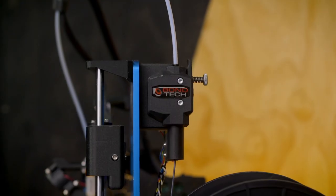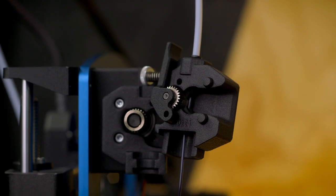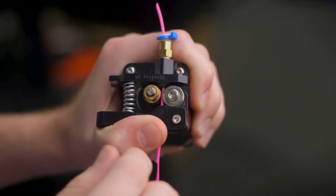How much retraction is needed with flexible filaments is entirely dependent on your 3D printer — specifically its extruder. Most modern extruders have a constrained filament path, meaning that almost immediately after the filament leaves the extruder gear, it is guided down a path so it can't divert anywhere else. Older extruders were more open, so within that gap, the filament could spit out and be unconstrained. With rigid filaments it's not a problem, but with flexibles, they're far more likely to spit out the side and coil around the extruder gear.